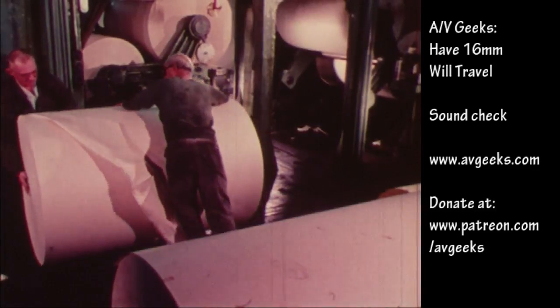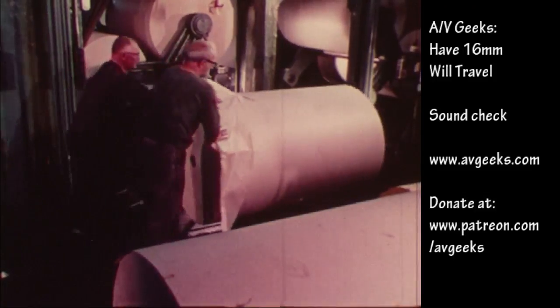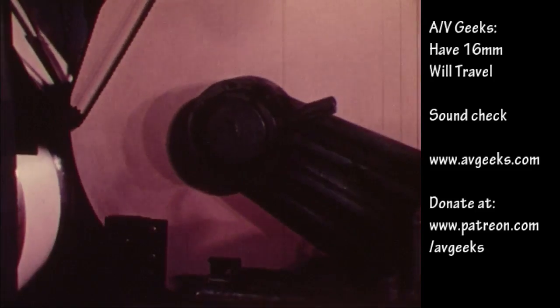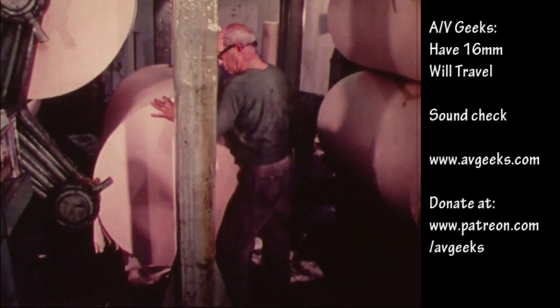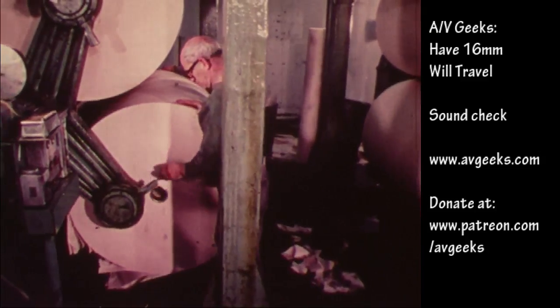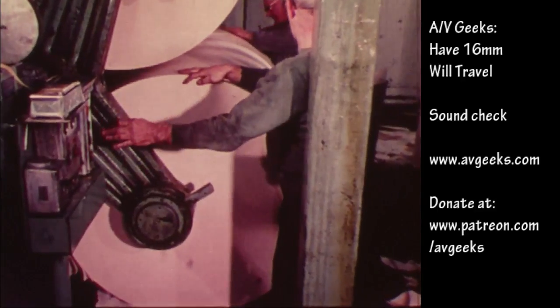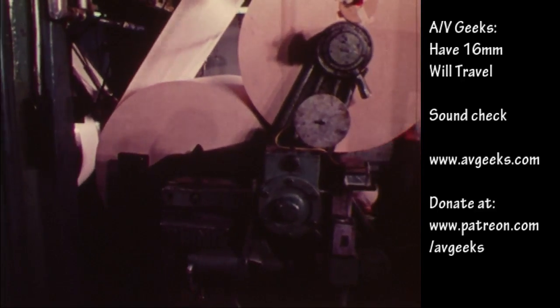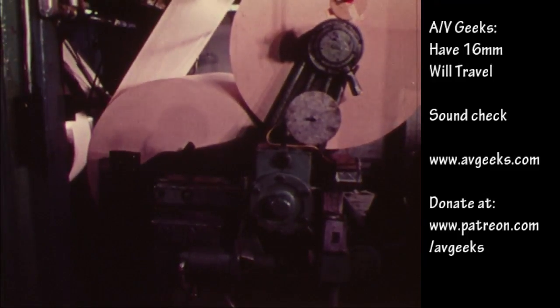I can tell you that one of these monster presses of this type will use a lot of paper in the course of the day, and we can load 3 rolls at a time. Our pasters are semi-automatic, and they can be changed to full press speed. Our rolls weigh about 1,800 pounds, and they're 60 inches wide and 40 inches in diameter. We use about 60 rolls a day. It's a lot of paper to shove into the press in the course of a day.